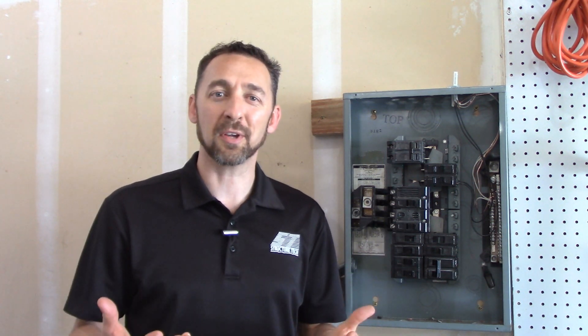If it's any other breaker, the manufacturer has listed it to hold one wire securely in place. When you get two wires, you may end up with a loose physical connection, and that could lead to a fire. Loose electrical connections can lead to fires — that's the entire concern with a double tap circuit breaker.